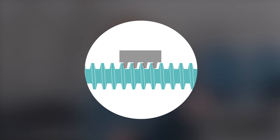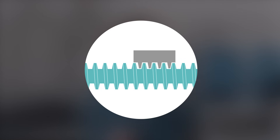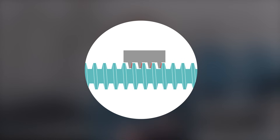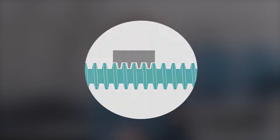So when the shaft pushes the nut in a direction and then stops and goes the opposite way, the shaft will move without pushing the nut until it has covered that little distance. Backlash is that little distance in which the motor and the shaft spin but the nut doesn't move. It results in a little desynchronization between the machine's theoretical coordinates and its actual position — a small difference, but still a problem when you want to do precision milling.